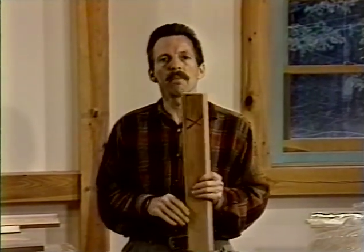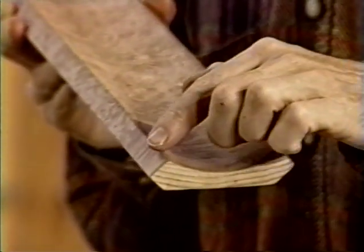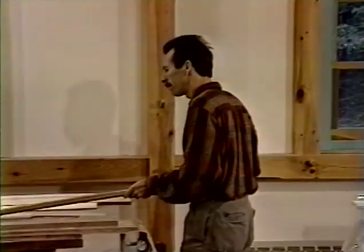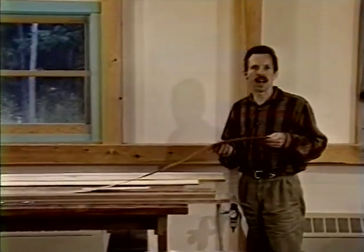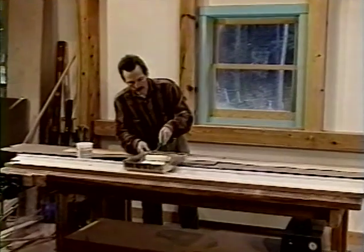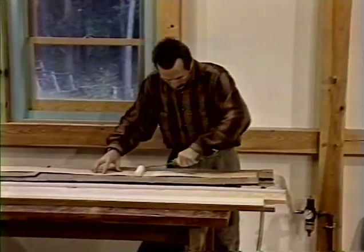With this cove, the main trick is the right angles to get the veneer to bend over this edge, down in and over the other edge. I use two simple techniques to soften it sufficiently. Look at this veneer. It's a bird's eye zebra wood. That's what's great about veneer. There's so many choices. I'm not sure anyone would want a zebra wood cove molding, but I think it would look great. First, I apply yellow glue to the veneer, like I did with the bullnose.